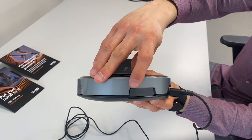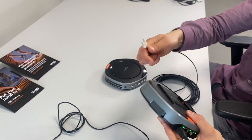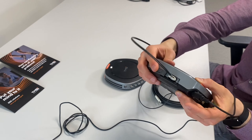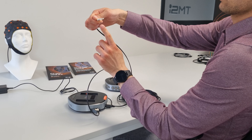The docking station features a fiber optics port and a trigger port. The fiber optics cable can be plugged in after opening the lid. Please note the orientation of the fiber connector — do not force the fiber connector into the slot. The notch must be pointed downwards.